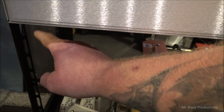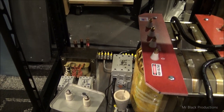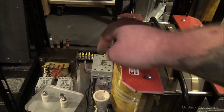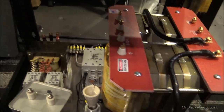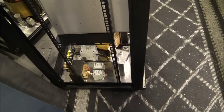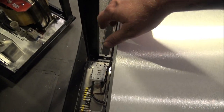The bleeder circuit's going to go right in here someplace, I do believe. I'll put my rectifiers in here. I will probably mount the high voltage cap somewhere back in here. And that'll put our glitch resistors in here. Lots of room for clearance. But this has taken hours and hours of trying different things and standing here thinking about it. And that'll leave me a lot of room on the back for the dual line sections.